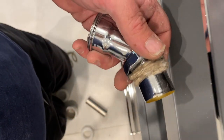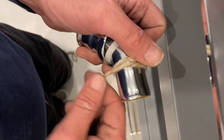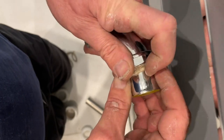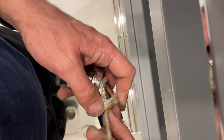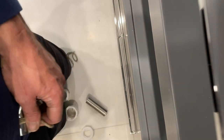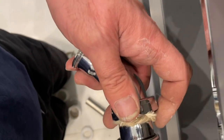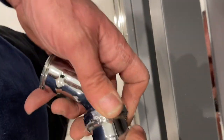It's a little bit of trial and error, and I haven't done this in a while, but I figured you guys would like the trick. I put it on the wrong way, so let's take this off and go this way — because when we spin that slip nut back on, we may have to lose that washer completely. I should take a little bit more off. The old school plumbers will appreciate this. All you new jacks out there will be like, 'What is he playing with yarn for, like a grandma on Christmas Eve?' But look at that — it's in there, nice and tight.